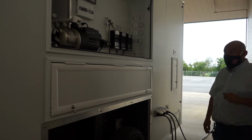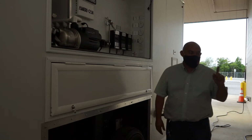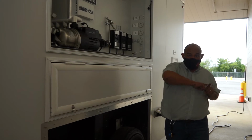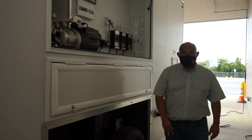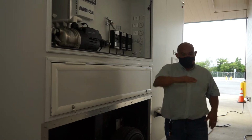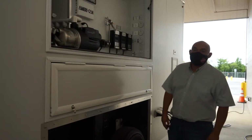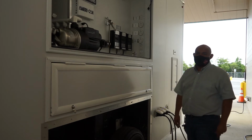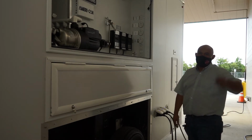Okay. But what I will tell you is that if you plug them all in to the same circuit, you'll probably blow. It's 3 different circuits, right? Yeah, so try to plug it into a couple different locations, not all in line, because you'll probably drop a ton of juice out of it. You'll blow out the lights in the building or something. And then you just have to flip the breaker.